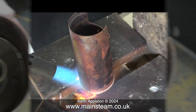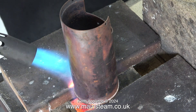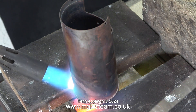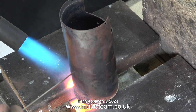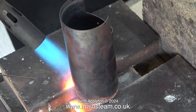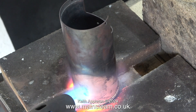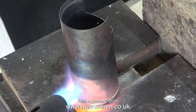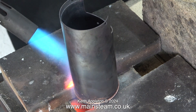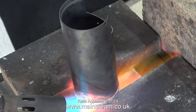The entire area including the groove in the top cap has been coated in silver solder flux. All I need to do now is heat up the part until the solder melts and runs into the gap. This took a while so the video is running at higher speed. The burner head I'm using is not too big and not too small — it's perfect for a boiler of this size and allows me to control the heat. I don't want to cremate the part; I want to make it hot enough to melt the silver solder so it flows into the joint.